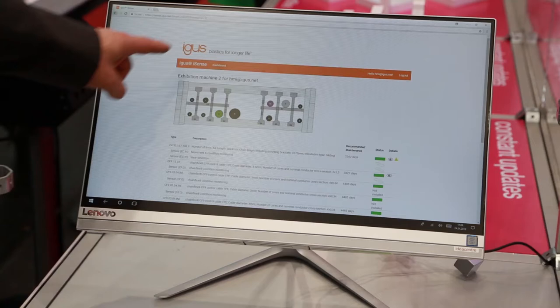At the day of installation, the given number is based on the output from the IGUS lifetime calculator available on the internet. This lifetime calculation is based on experience from the biggest lab for dynamic applications in Cologne, many thousands of applications in the field, and the experience of our engineers. The lifetime calculator is filled with the weight, the stroke, and the speed, and gives a statement of the lifetime in double strokes.